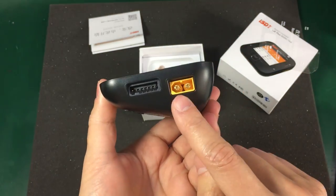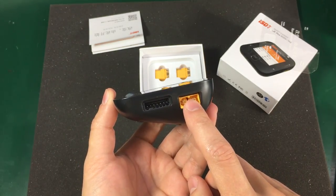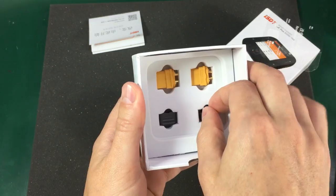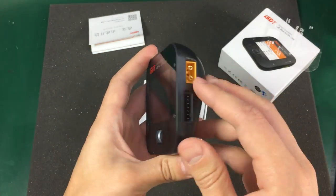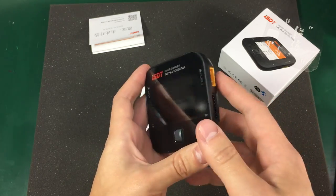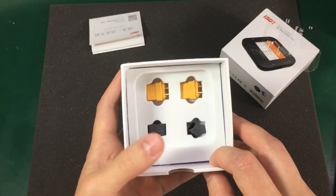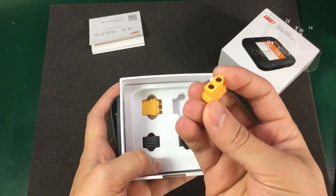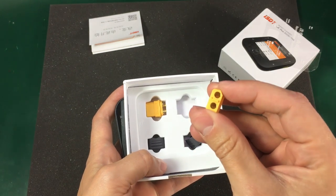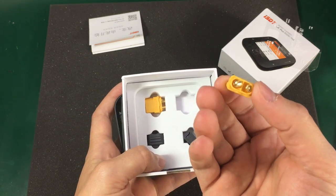On the sides you get this output port for the battery, and this is the input port for the charger — both are on XT60 connectors. Inside the box you get a pair of XT60 connectors with some shrouds, which you can use to build your own input cable. On the output you connect your XT60 terminated battery directly to the charger, but on the input you might need a custom cable. XT60 connectors are really nice polarized connectors — you can only plug them in the correct orientation and they can carry a lot of current, which is why they're so widespread in the lithium battery RC world.